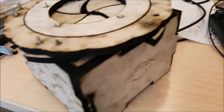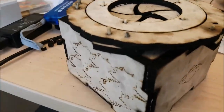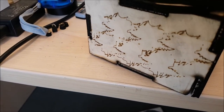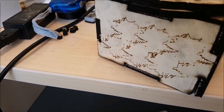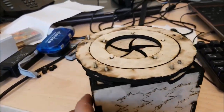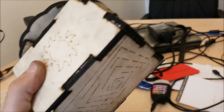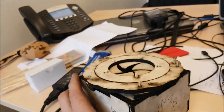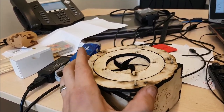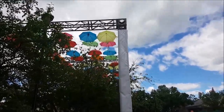Had more fun in design than I had in the outcome. The cut didn't work so well — it's too thick, made of birch plywood, a little ambitious. If you leave the laser at low enough power it doesn't actually get through two layers of masking tape, so anywhere it was doubled up my etching didn't come across. But the sizing all worked, so at least I'm happy about that. It holds together as a box, even if it doesn't work all that well. Didn't expect to see something like this today — I like it. I'm gonna give it four stars.